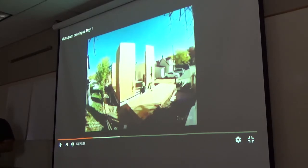And what's interesting, Sean, is that in all the framing I've done, I've never really thought of the press plate engineered trusses to be the least accurate thing on the job site. But compared to these panels, that's our biggest problem. But they do vary, yeah. They vary up to 1 inch. It was incredible. All of the moving we had to do was because these trusses were terrible, in reference to the panels. The panels are so tight that all of the sins of everything else show up.